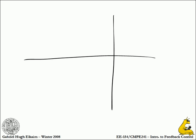I'm going to look just at my lead compensator. My zero, my pole. So this is A, right? And this is B. No, this is B and this is A. This is S plus B over S plus A. And we're going to put a K in front of there, but we'll deal with the K later. But this is the compensator I'm putting in.